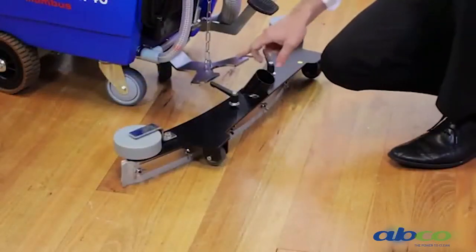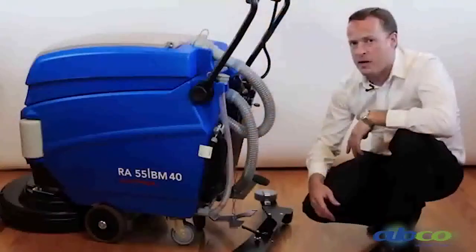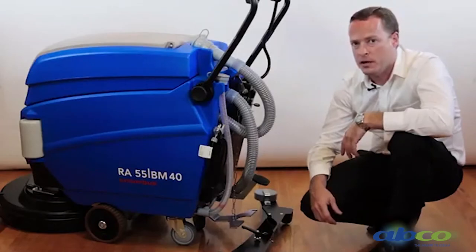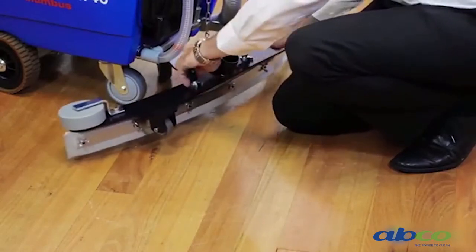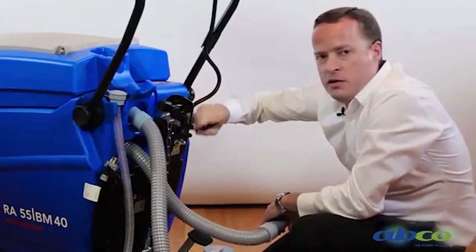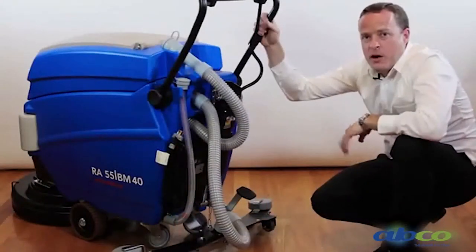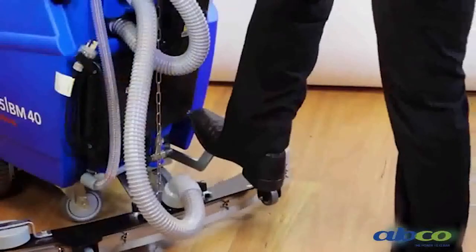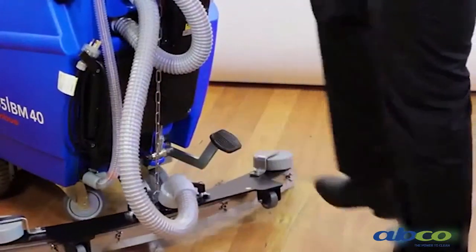You'll notice we've got elongated holes here where the squeegee assembly is mounted. That is so if the squeegee does get caught on something — because this is a traction drive machine — it won't damage or twist anything on the machine. It'll just pull off the squeegee and you'll have to refit it. To raise and lower your squeegee assembly is just on this handle here — very simple, just a manual operation. It's either down when you're using the suction, or you can lift it up. To raise and lower your brush deck is on this foot pedal here — done by your foot operation. Very simple, it's a matter of twisting it sideways to drop your brush deck, and then pushing it down raises the brush deck.